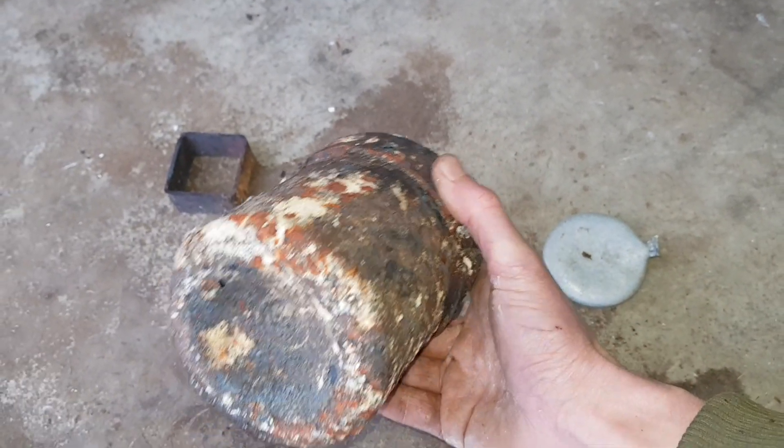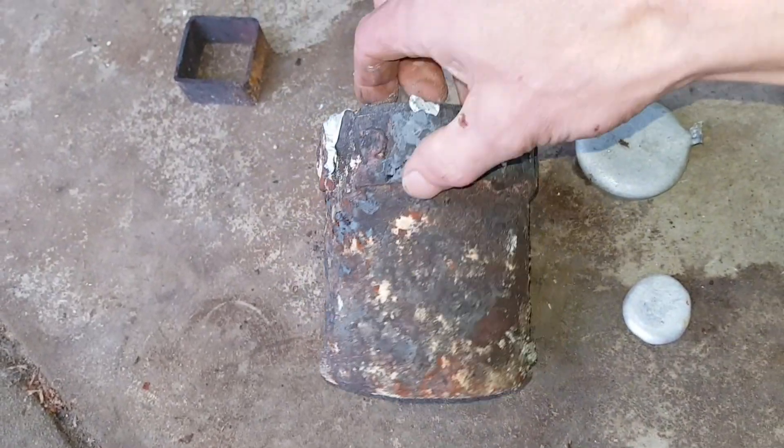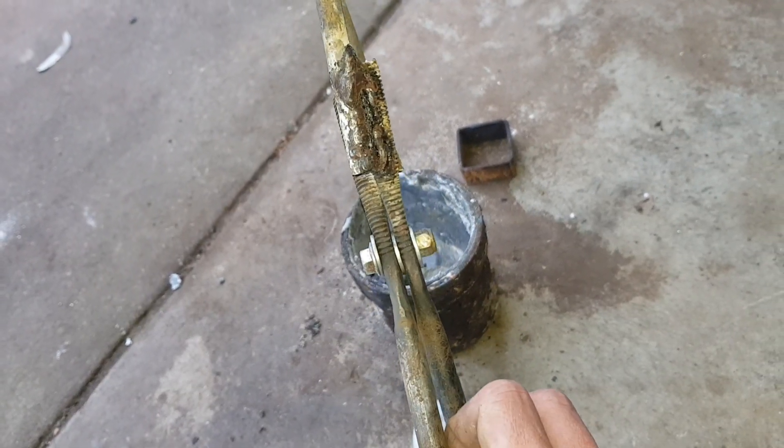Oh, the crucible - the actual melting vessel - made from the base of an old fire extinguisher. I bought one years ago when I messed around with this for a couple of weeks and lost it somewhere, so I'm still waiting for one off eBay. Shout out to job - chopped another ring off it, drilled it, tack welded it, welded the whole ring around. And made these custom crucible tongs which actually fit perfectly, so you can pick it up and pour. We actually used the forge, heated them up, flattened them out to make the hinge, then welded together.